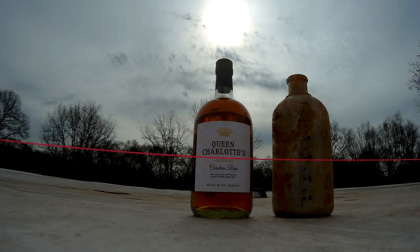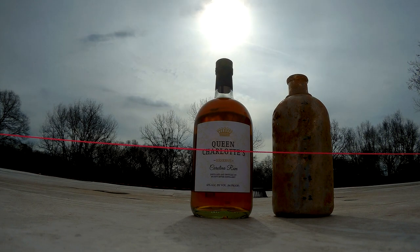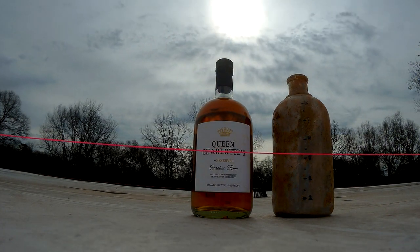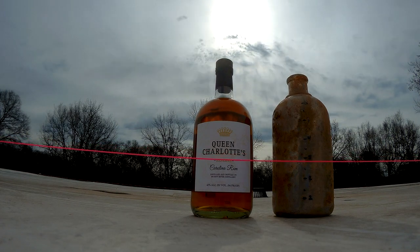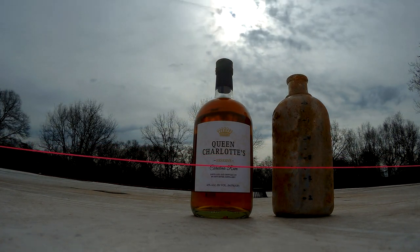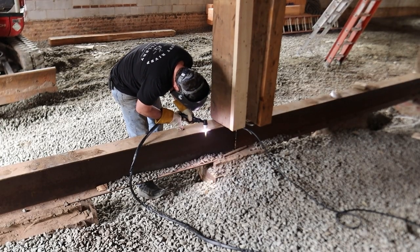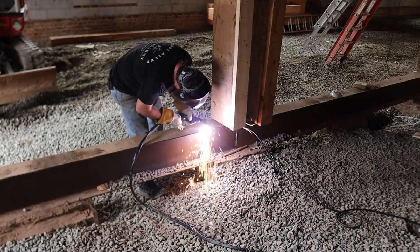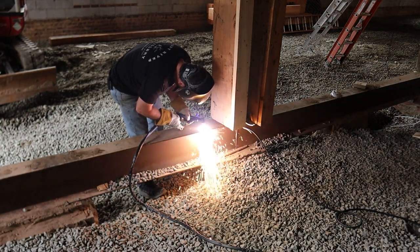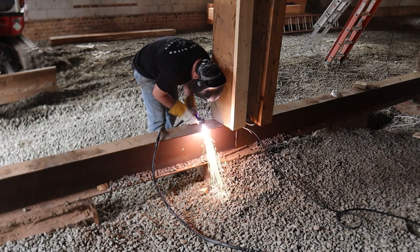So we went back down at one point, we had to readjust, and then there should be just the last lift, which is the big one. Zip, and there she goes. And now you see with that, the string was still 2.5 inches below being level. So there's still a need for a roof drain because the water doesn't drain to the outside. There's no pitch, there's an inverted pitch, we could say.